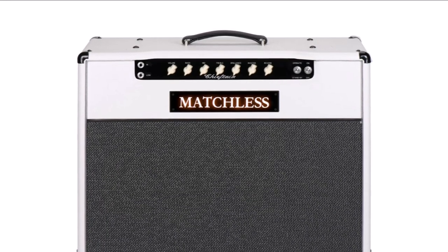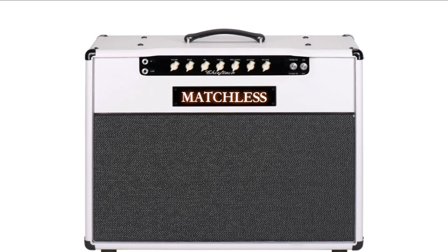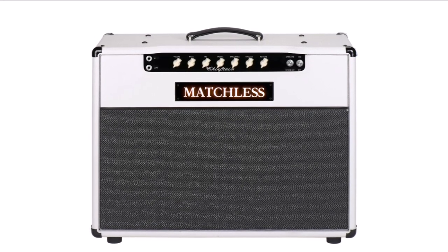Because ultimately, when it comes to something like an Axe FX, maybe half those models are truly redundant. If you had access to all of the advanced parameters that the software developers do, you could absolutely compensate for the differences between a stock 2204 and something like a Cameron Atomica. Because an awful lot of amplifiers that we think are different really come from the same circuit topology. So if you add a little more gain here, or sprinkle in a little more bass there, or change the power tube bias or whatever, you get a fundamentally different amplifier sound, even if the schematic is relatively the same.